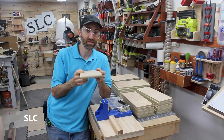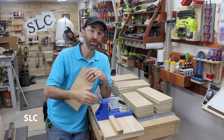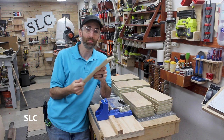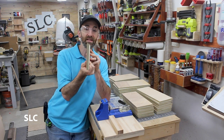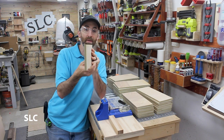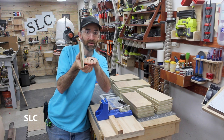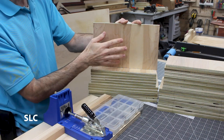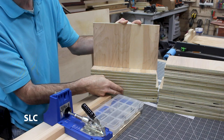Now it's time to prep all those sides for assembly. I'm going to be using pocket screws — that seems to be one of the simplest ways to do it. You could do dovetails, dados, or rabbets, but pocket screws are the simplest so we're going to drill those holes. Also take into consideration if your wood has any kind of a warp to it. If so, make sure that warp goes to the inside of the drawer so the base we're going to apply pinches it together and holds it even better. Remember when you drill the pocket holes, they go in the front and back boards — in my case the 12-inch pieces, not the 13-inch pieces.